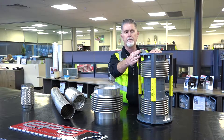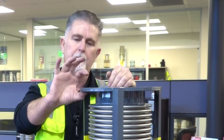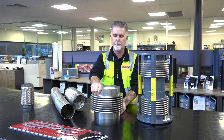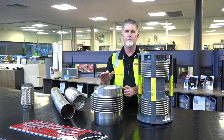On this piece of equipment, when the bellows is fitted up, if the bolts can't slide easily through the pipe flange, that means it's going to twist the bellows torsionally. If it's twisted torsionally, it won't last — it will fail.